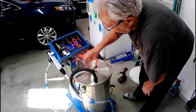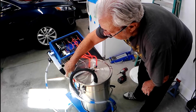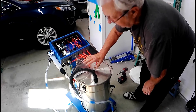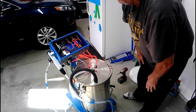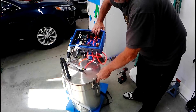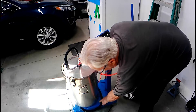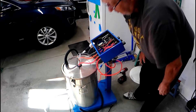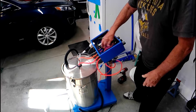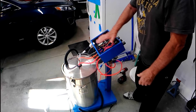The venturi creates a low-pressure area that pulls the powder up into the flow path. The white cloud port adds more air to ensure the tube has enough flow so it doesn't plug up or produce clumps. The clear hose labeled 'gun' goes to the gun tip to keep that from plugging. All three of these functions just ensure powder travels from the tank to the gun and onto the workpiece. I'm going to cut about 20 inches off that vent tube — I had to fix this because these two fittings were inverted from the factory and nothing worked.